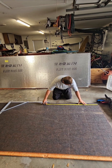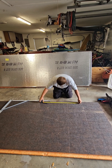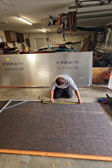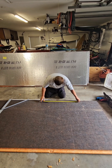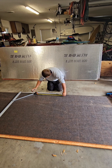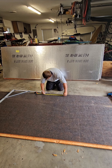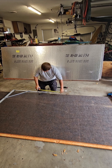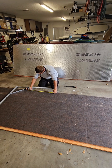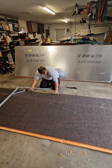So the first cut is our 17 inch side. The next mark needs to be 21 minus three inches, which is 18, plus two and five eighths, which is 20 and five eighths. That'll be our second cut. The third cut needs to be the same as the first cut, and then you add two and five eighths. And then the last cut will be 21 minus three inches, which is 18, plus two and three quarters inches, and that accounts for the shiplap on the last bit.